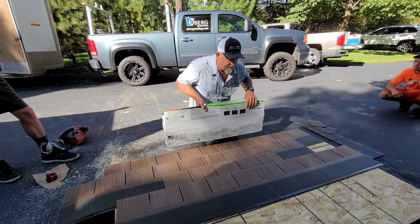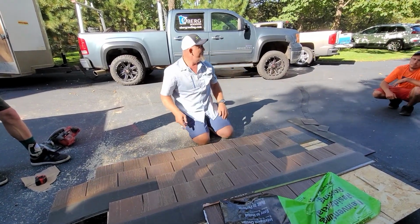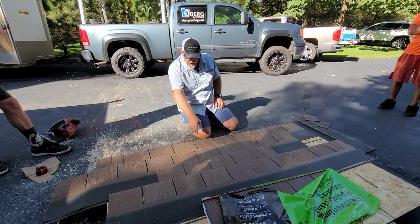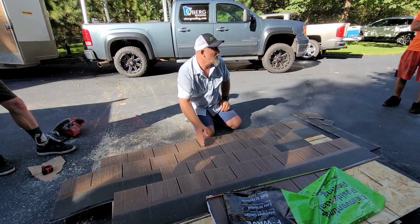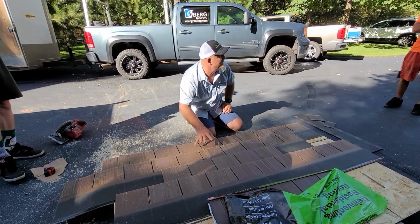The best thing for you to do, and I'm going to say this into the camera, is when you're done at night, before the sun goes down, you look at these shingles. You have one guy on the ground, and walk around and say, that one there, and you go over and see what's holding it up. There's always something underneath it. It wants to be flat.